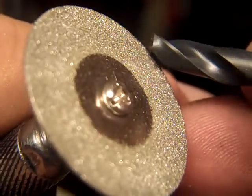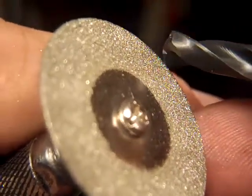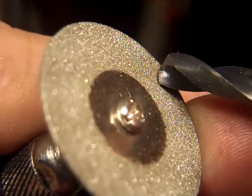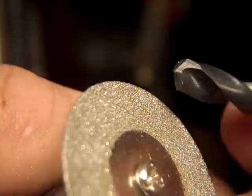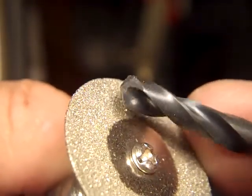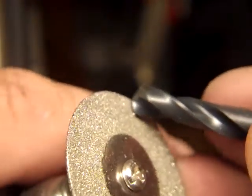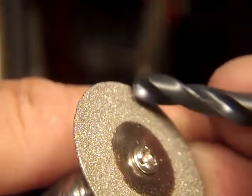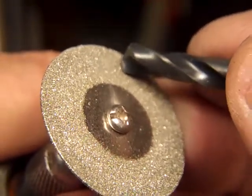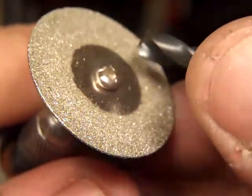Basically, how I use this, I'm not going to turn it on right now because I'm using a $10 camera with a 1¼-inch screen, and I can barely see what I'm doing through it. And I'm wearing 8 power glasses. But anyway, you see this is a number 2 drill. It's about 1/4-inch. And it's a split point bit. And the way I sharpen these, or change the tips, I should say, I grind them into bullet tips. That's one of the very common uses I do with these. I grind bullet tip drill bits for cutting dies and molds.